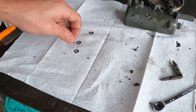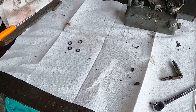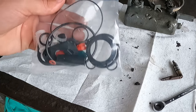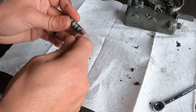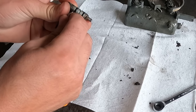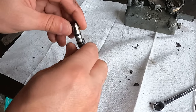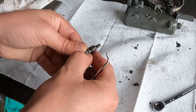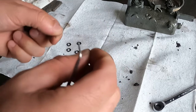I found my four O-rings I'm going to need out of my kit. Hoping I don't have to go further into this pump, because there's an awful lot of seals and O-rings in here. The old O-ring is hard as a rock — it actually just broke. It's very brittle. No wonder why it was leaking.